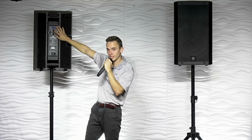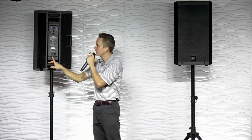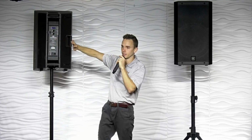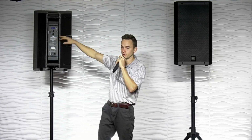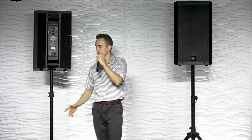But it also has treble, mid, and low end that you can adjust as well. If you're going to be pairing this up with subs, it has cutoff filters on there. So if you've got anything 80 hertz and above, it'll do. Anything 120 hertz and above, this will do, and it will leave the 120 hertz and below to the subs, okay?